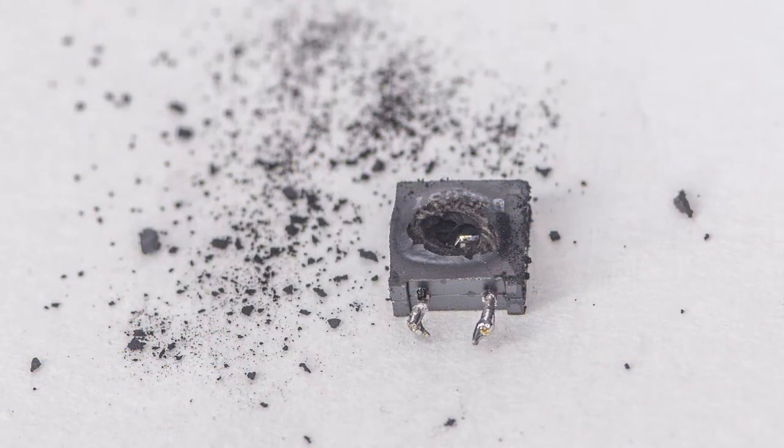And after removing the resistor, I just scratched it a little bit and all the magic smoke released. So yep, there is no 100 ohms in there. I measured it with my Keithley 2002 and it shows like 0.5 gigaohms, so it's blown open.